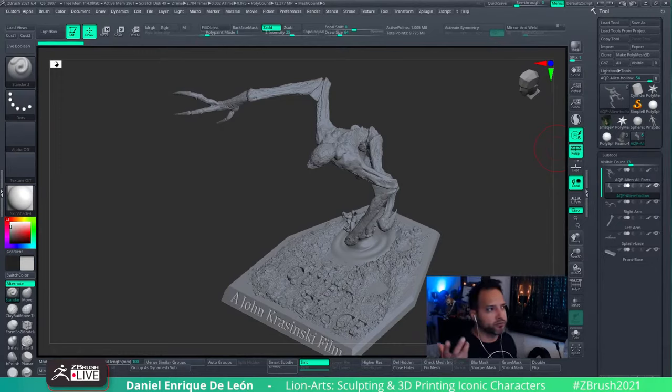So with the Form 3, the light processing unit moves across the bottom, sort of gently scraping or pressing up against the film layer. That's the transparent bottom layer that's flexible. As it presses against it, it's pressuring it inward slightly as it's printing. And then as it washes past, that area relaxes again. So that's almost like a natural peeling process against the build platform that's taking the layers that have been printed and pressing them against the base of the clear tank.